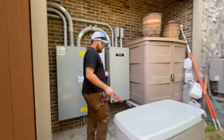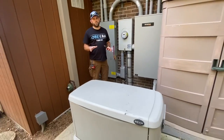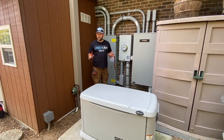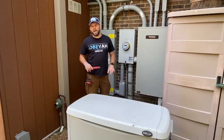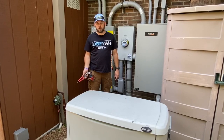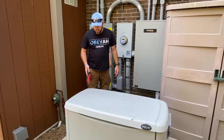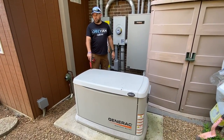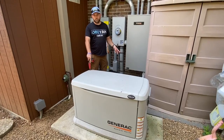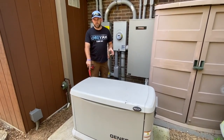I'm going to step back outside for just a second. The last point I want to make on this system — and it's something a lot of people just don't understand when going off-grid — is that redundancy is everything. You can have the biggest, baddest battery bank in the world, and if you have a week of cloud cover and no power, that battery bank is just as dead as if you had a small one. Having a generator, having some kind of supplemental source, having multiple off-grid inputs whether it's photovoltaic modules, wind power, or hydroelectric — it's always good to have as much redundancy on power production as possible, along with backup power.